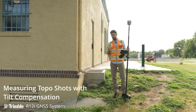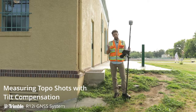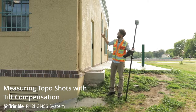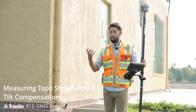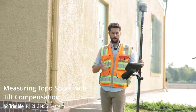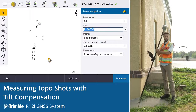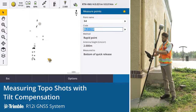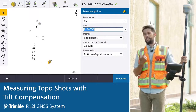Another really good example for a surveyor of something that's been difficult, if not impossible to pick up in the past, is a building corner — particularly with a GNSS system. Obviously it's inaccessible; we can't get level over the building corner. Also, the likes of this tall building here means we have no access to the satellites in the sky, so getting a position is difficult. With the pro point engine we're able to get those positions far better than anything we've ever been able to do before. And with the tilt, we can also get in to get that building corner. All we're concentrating on here is the position of the tip of the rod. We can see that our residuals are good. We can take a shot — that easy. In the past it's almost literally been impossible using a GNSS system at least.